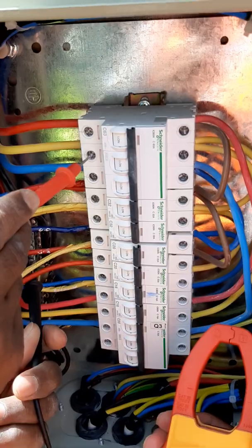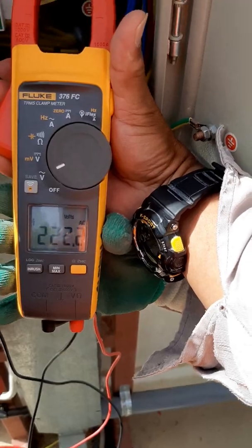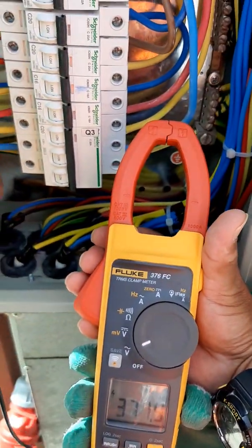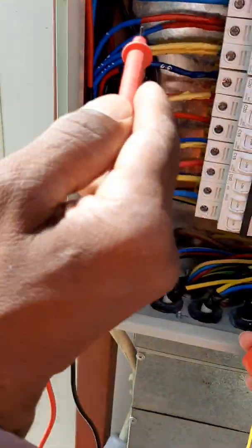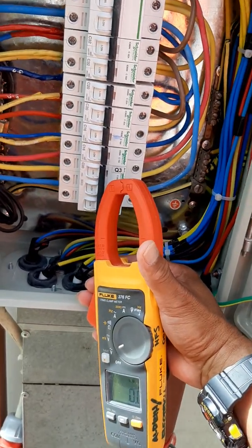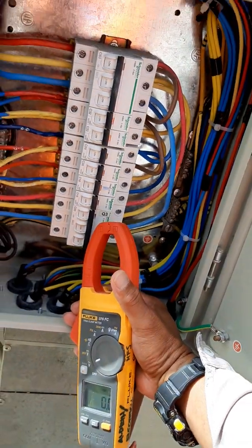Now we try the yellow for line two — reading 220 volts. Then line three, the blue color — reading 222 volts. Now line to line, you can check: reading 372, and the other one 374. So our supply here is 380 volts. Our transformer primary is a delta connection and the load side is a Y connection, so we can use neutral and take a 220-volt supply, line to neutral — we can read between 220 and maximum 230 volts.